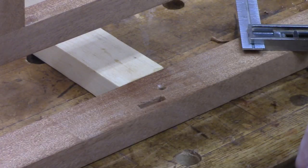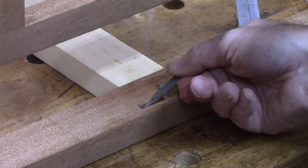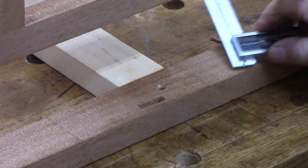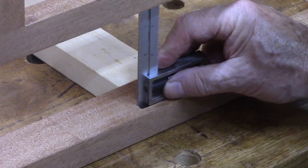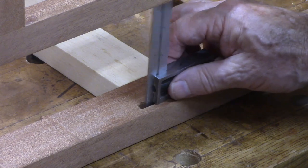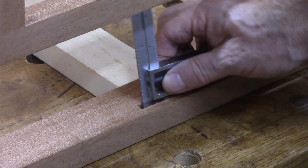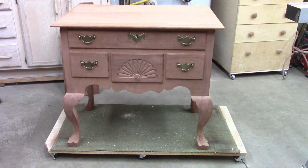I've been chopping away at the mortise with my small chisel and I think we've got it deep enough and flat on the bottom. This gauge is set to the height of the lock and it does move around in there - there's a little bit in the corner I think it's touching, this side is clear, a little bit down in here. So there we have it with all the hardware on, and there's nothing left to do but sand, probably dye it, and then add a spray shellac finish. The construction is complete.